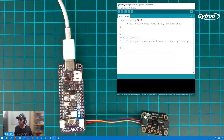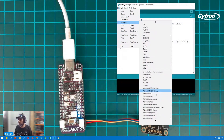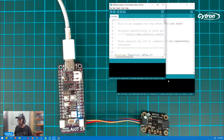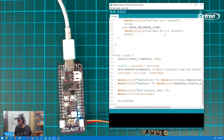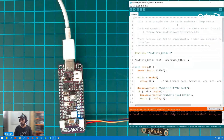Close the library manager. Next go to File, Examples, and scroll down. First we test-run the SHT40 sensor to see if everything is working fine. Here's the library example for the test. Let me open it. Nothing much here to change, so we just try to upload it first. I'm not sure of the port number yet since I haven't reset it, so let's see how it goes.